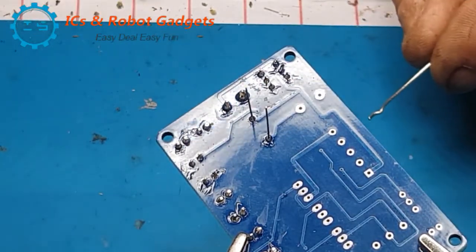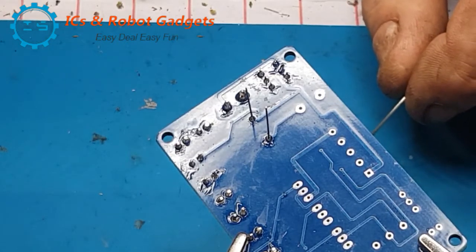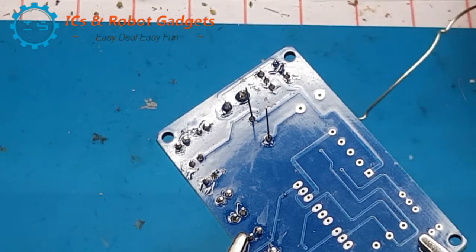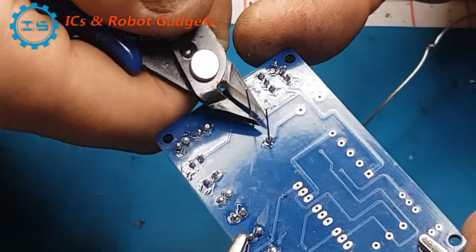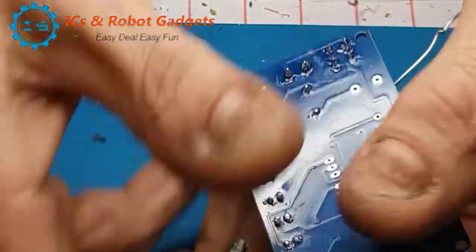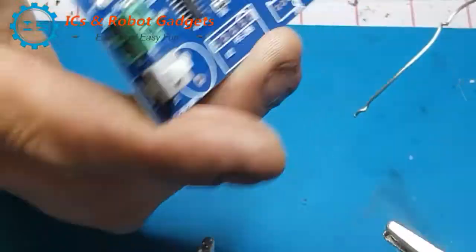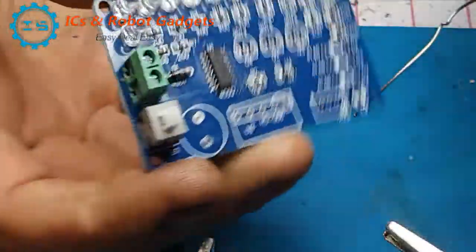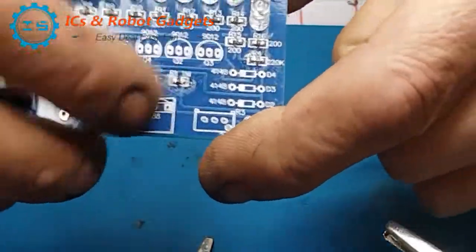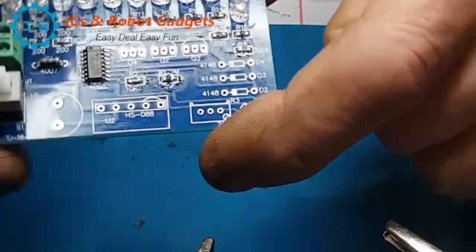Oh, there we go. I've bridged it and unbridged it. Put that over there for a minute, out of the way. Turn it off for a moment. So we'll snip these two down. So that's our switch, Schottky diode, and I'm going to leave the speaker to last so it won't interfere with this. So basically we want to get these three transistors in next.